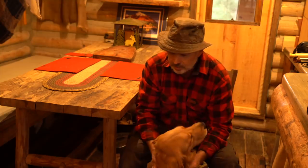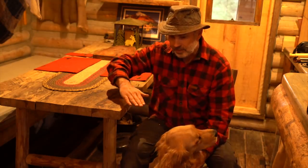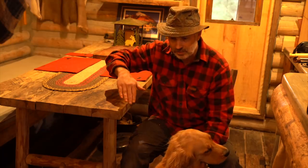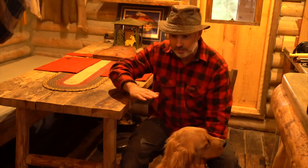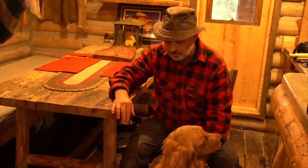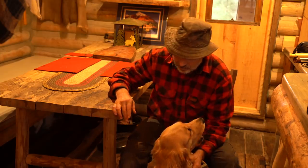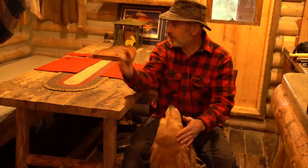Two problems with that. One is that when you don't fasten unseasoned wood, or you don't weight it down, it starts cupping and twisting. A lot of times it's the twist that's a major issue. So that started happening. The ends of the boards started coming up, and it was a tripping hazard. And then, of course, the gaps were widening.